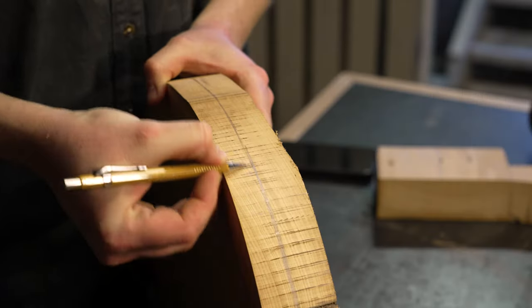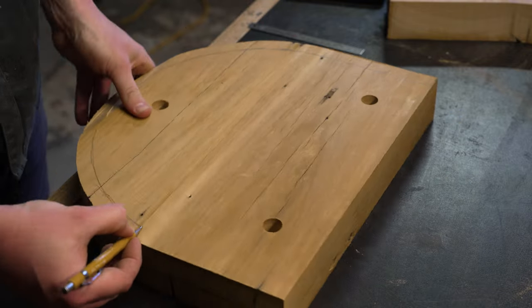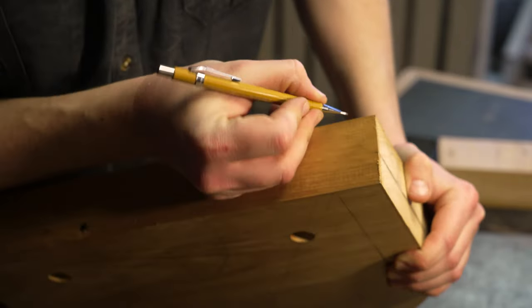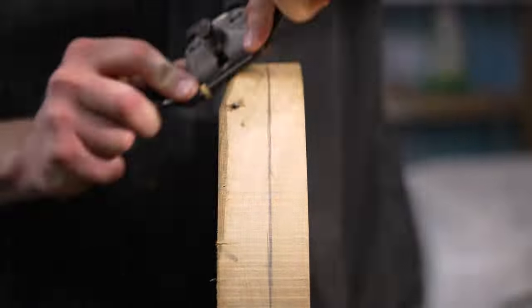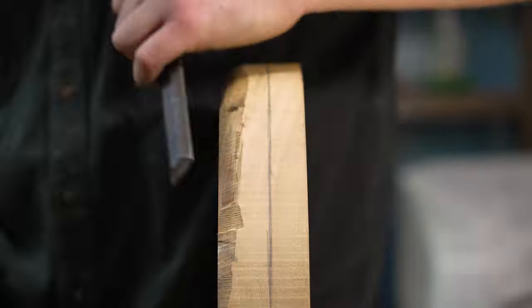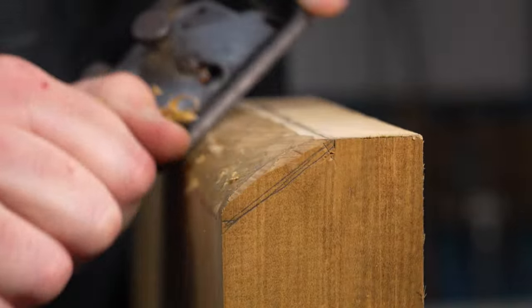In that photo, around the back of that stool there was quite a big chamfer which gave it the look of being quite a thin seat base, but my legs are going straight through whereas those ones were just nested up in the seat itself, so it would have been a pretty thick seat. This would have been a perfect opportunity to pull out the draw knife if I had one, but I don't, so I was hacking away at this forever. I kept putting a little chamfer on the end there so that when I was taking my material it wasn't just chipping out on that front face.